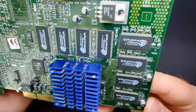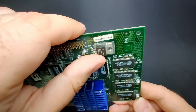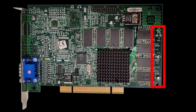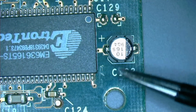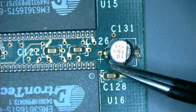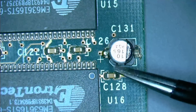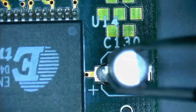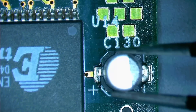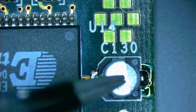Let's move on with a few repairs. As I mentioned before, the card is missing one capacitor and a heatsink for a voltage regulator. I have seen quite a few cards where those capacitors next to the memory chips are missing — they can easily get knocked off, most likely while storing cards with other components. I will also check the neighboring capacitors, since damage may not always be easily visible. One capacitor looks a little odd, so I will remove it, measure its value, and if it is okay, put it back. For the empty pads, I need a new capacitor. Luckily I have a few spares. These capacitors may not seem critical since the card works without them, but they will most likely improve stability at higher frequencies and help filter electronic noise.